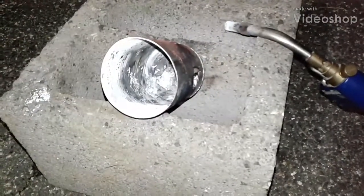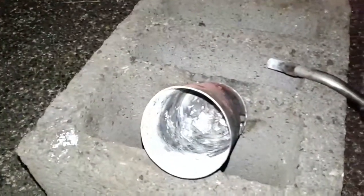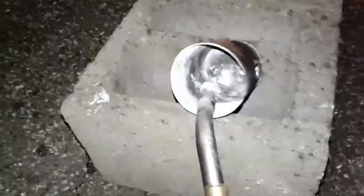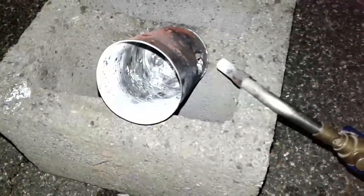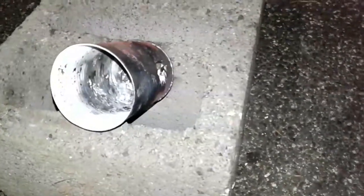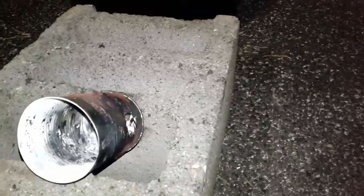For melting down zinc, the only thing I've ever needed is a soup can and a blowtorch. Zinc melts at a low temperature of 700 degrees. I knock a hole in the side of the can because just putting the blowtorch in the top suffocates itself, but putting it in the side gets a lot of air and it melts. You can see how rusty the can is — I just began using this one 20 minutes ago. They rust super fast, so every day you do this you're gonna have to use another one.